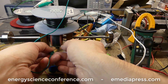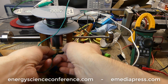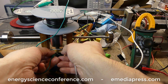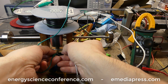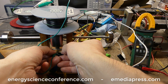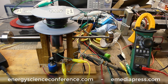What this is showing is that when you short the coil at the right time — depending on where I place the reed switch, it shorts the coil at a different point relative to the magnet and core. Rotating the position a bit, we get to 20 volts, 22, 23, and almost 24 volts.